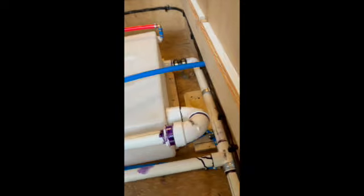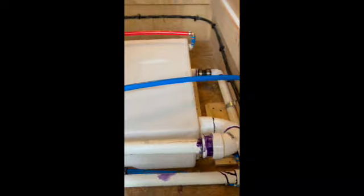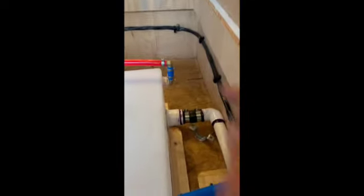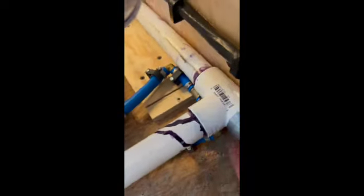Here's my vent for this tank, here's my infill for this one, there's my drain for this one, and here is my supply line for this one — and over here is my supply line for the other one. The supply comes out here underneath and I've got a T: it tees off this tank and it tees off that tank. There's the T right there, and it goes through the wall into the garage where the pump and the hot water tank and all that other stuff is going to be.